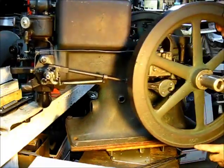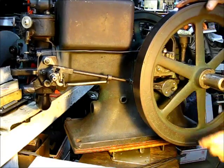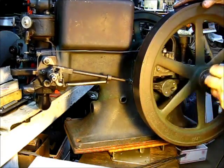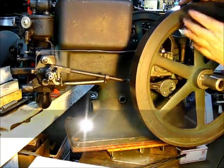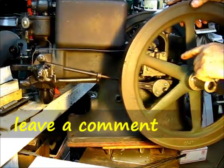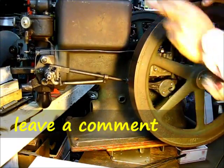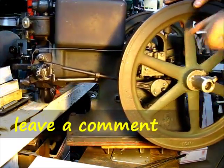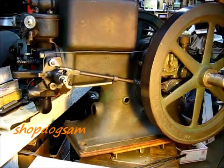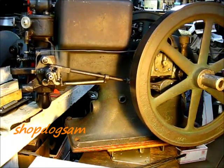It fired. This is in the correct position — the two marks line up there. I could get a straight edge and put it in there, but I can see that everything is exactly the way it was. The magneto timing to the igniter is indicated by those marks lining up right there. So we're good to go. I'll set them tight and we'll do something else later — we're good to go.